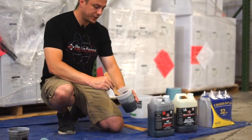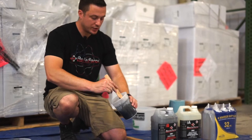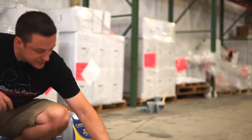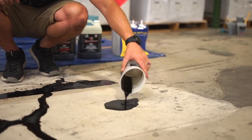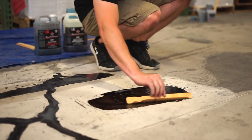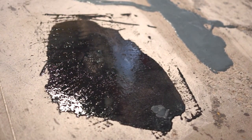We'll mix this — if you're just doing a liquid with no sand, about 10 to 20 seconds is all you really need, just to make sure it's uniform. One-to-one, this is going to dry gray. Once we're mixed, we can come in and pour it into our little spalls like that — a little too much actually; doesn't take much. Another thing you could do is use this to grout coat. Once it starts turning gray, you know it's curing. Once it's rock solid, it's ready to grind.